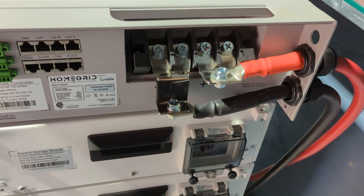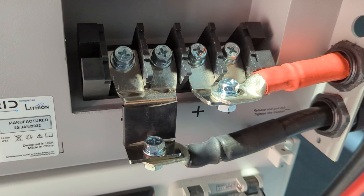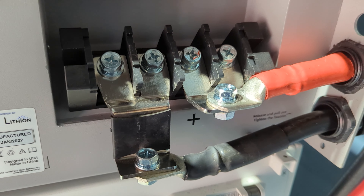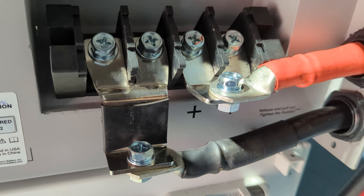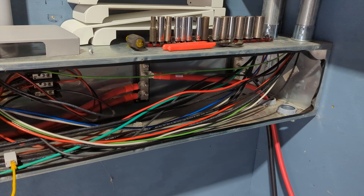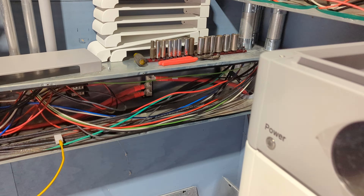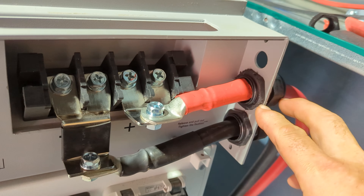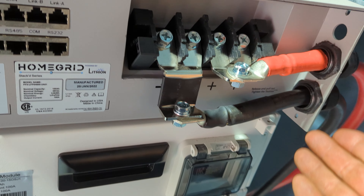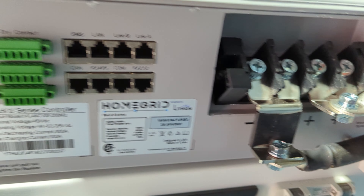For battery connections, we landed 4/0 wire — you can land up to 4/0. We use the Cobra Flex battery cable, which is overkill. We could do this in 2/0 Cobra Flex, which will carry 356 amps. But 4/0 will fit, and we're landing it on Blue Sea bus bars, so there'll be no losses. Put cord grips in here to keep from cutting the cable, and it's just enough room to get the cover on.